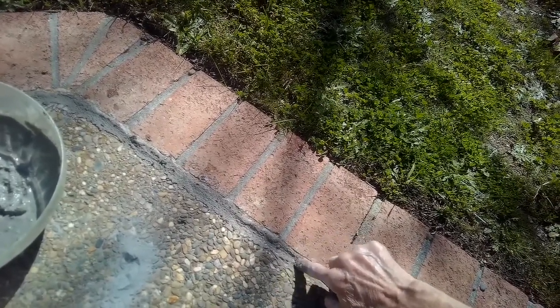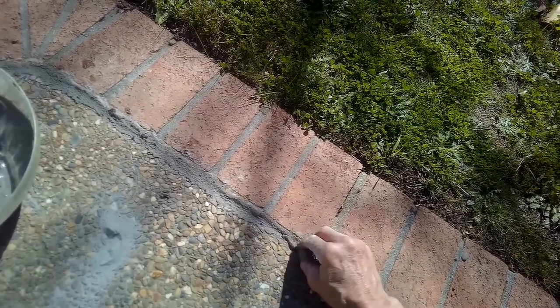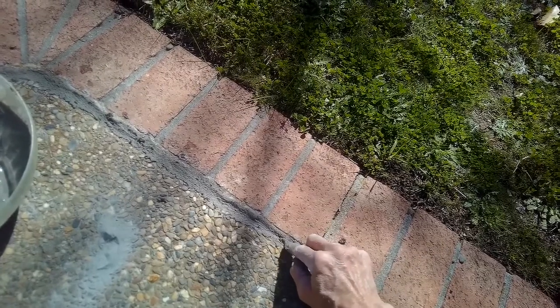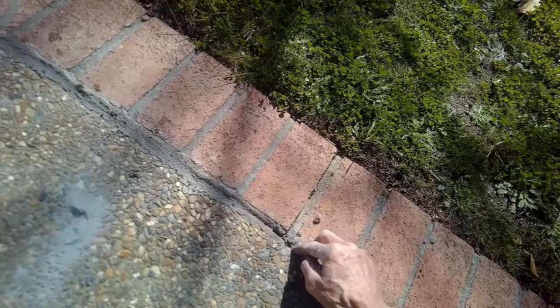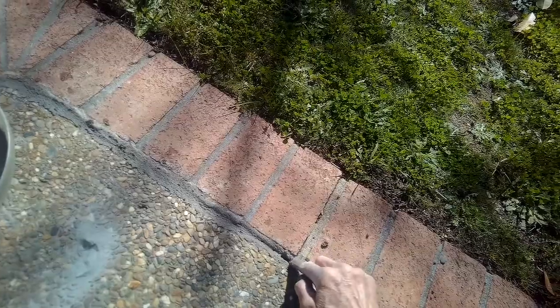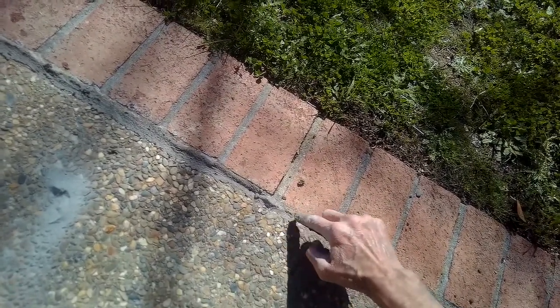This is going to be an easy job, and it'll look a lot better. If you don't do it, you're going to have bricks missing and it's going to look really bad. You have to think about these cracks — they're not just a centimeter deep, they go down as deep as the brick. So if you can put a little bit of material in and push it down into the crack, then do a little more to fill it completely, that's better. If it's just a surface patch, it'll probably show another crack pretty quickly because it's essentially hollow and unsupported underneath, and it won't last very long.